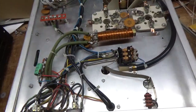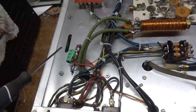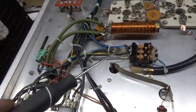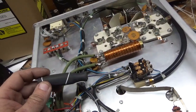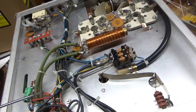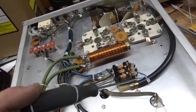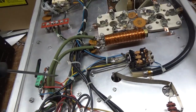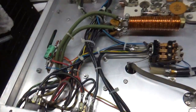I'm back with the bottom. I'll show you everything I did down here. I changed the electrolytic cap — I always change that. Ended up changing the wire. As I showed before, someone moved the resistor down, which is part of the bias mod, but they left the 110, 120 volts DC here at this contact. So I removed that and went right to the coil, but the wire was too short and it was riding right next to the output center conductor lead going to the output connector. So new Teflon wire, silver plate.